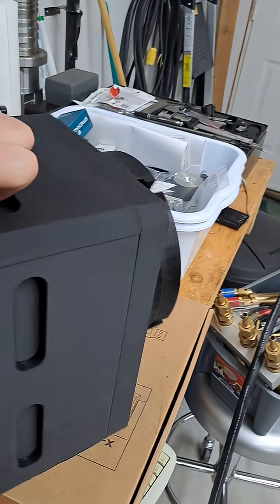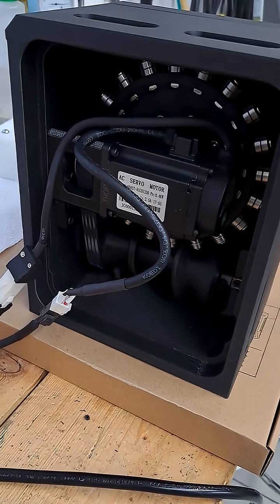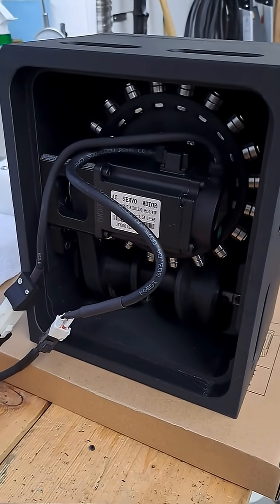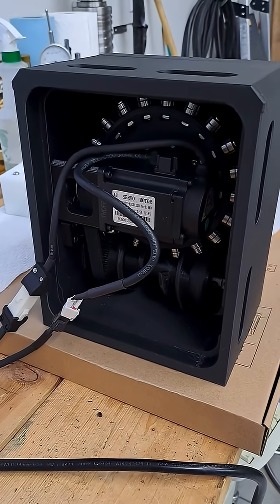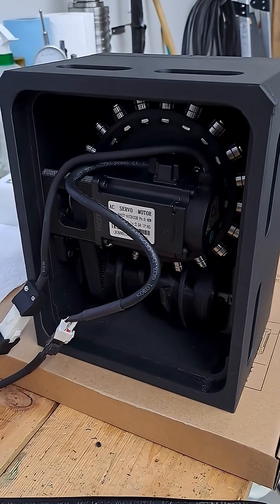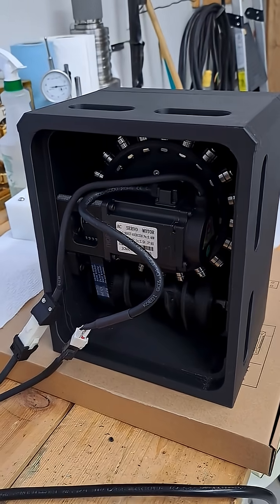There was a little bit of a grinding noise in this particular model and I've isolated it down to the timing pulley that drives the roller cam at the bottom. I did print that with my old 3D printer, so there seems to be some inaccuracy that's preventing it from meshing with the belt as smoothly as it should. That's where the source of that noise is coming from.